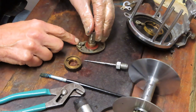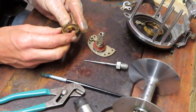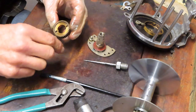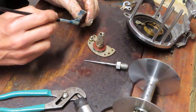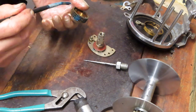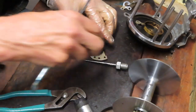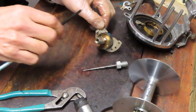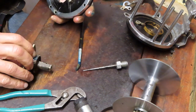It's a one-hop on a heavy-duty piece of metal here. Check the teeth - make sure they're all clear. They are. Put a good amount of grease into those channels. You don't have to glob it on, but make sure every now and then you get it down there, because the dimensions of the pinion gear and the main gear are different. You don't have to worry about it spreading around - it will. Then snap that back on. That's your gear service. Give it a spin - make sure everything's working properly, which it is. That gear can go get reinstalled right now, so let's put that right back in.